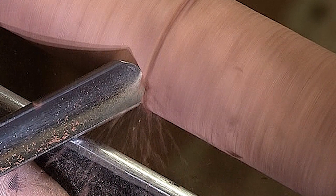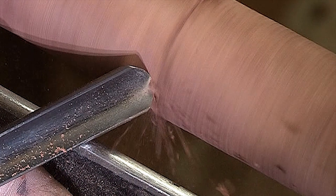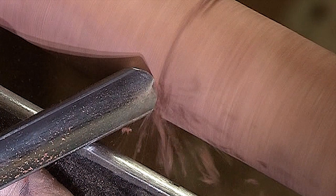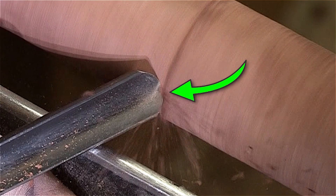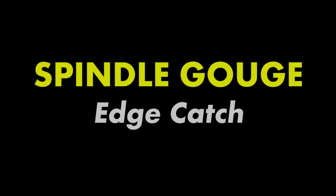Looking closer, you can see how it's below the center of the tool where the cut is happening. This is very important because if you lead with the tip and have the tool supported, you're going to get a good cut and not a catch. The green arrow is where the cut is happening, and the blue line is directly in line with the cut going through the tool — that's where the tool is touching the tool rest. That's what they call a supported cut. But if you cut up in the red area on top of the edge, where the yellow line is, that part of the tool is not touching the tool rest — it's not supported — and that will cause a catch.